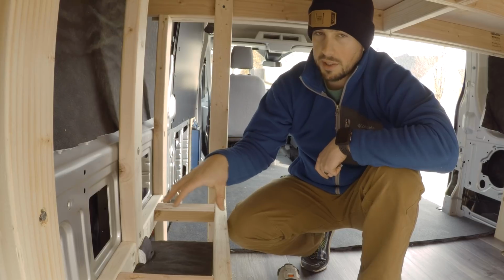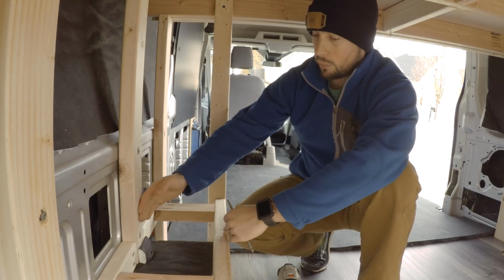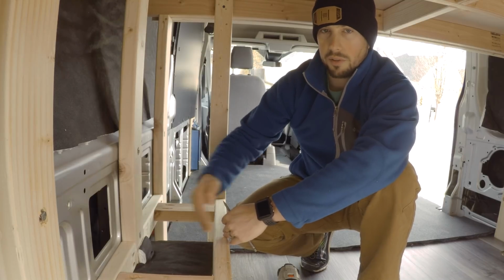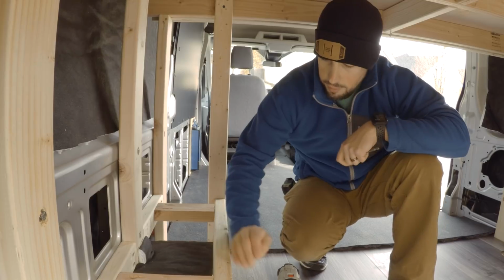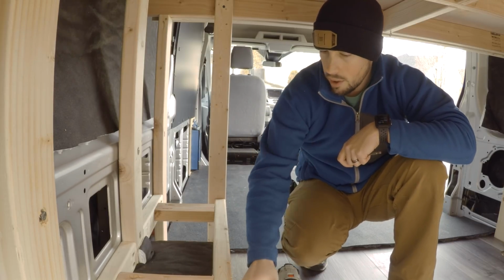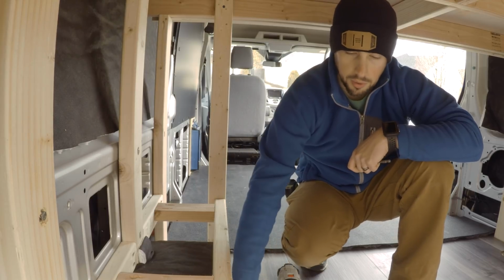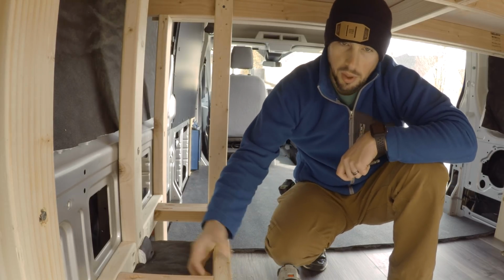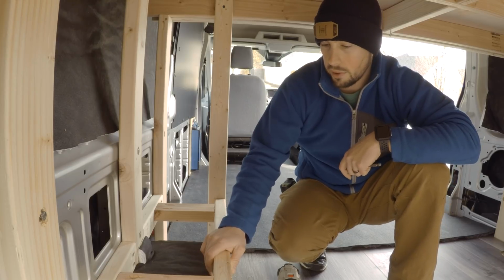There'll be a 16-gallon water tank here. It's about 26 inches long, about 9 wide, which the space has been measured to fit. I'll probably put another 2x4 or 2x3 support in a few spots so that any of the weight on this 2x3 here will actually go directly to the floor, which may be overkill, but I'll probably have a few scrap pieces that will fit in just fine.